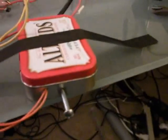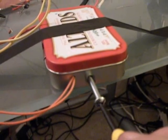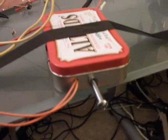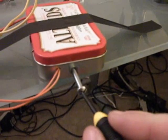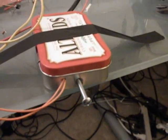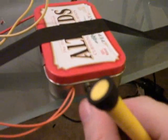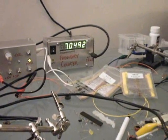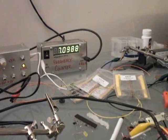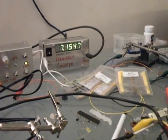I will use a screwdriver to twist the screw. You can hear it's very stable. And this will tune a very wide range. I'm not going to sit here and tune the whole thing, but I will demonstrate that we can cover pretty much all of 40 meters — about all of 7 MHz that we need.